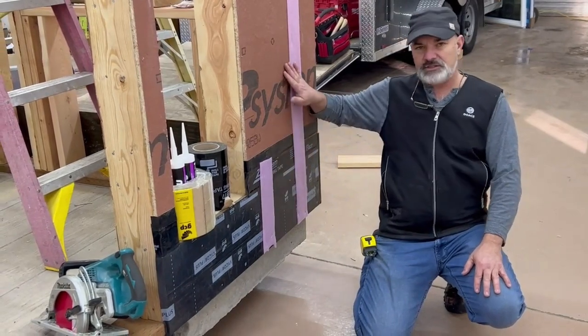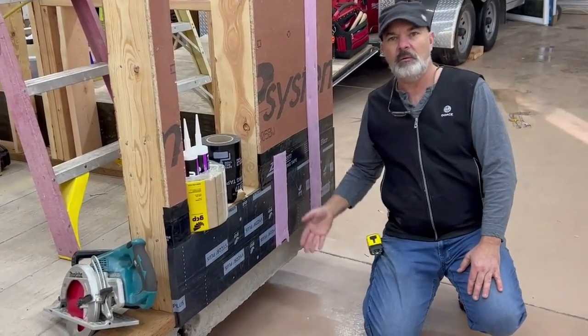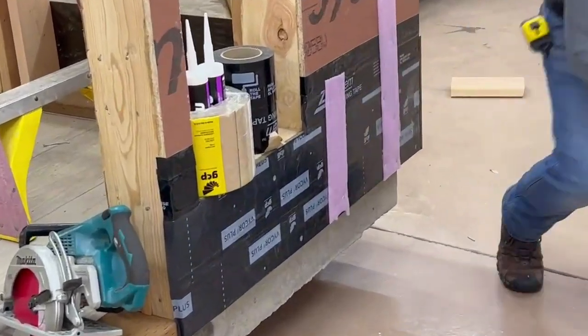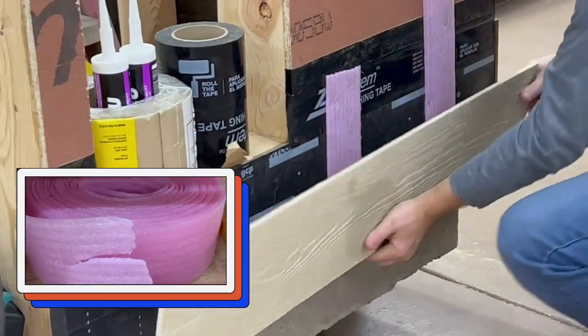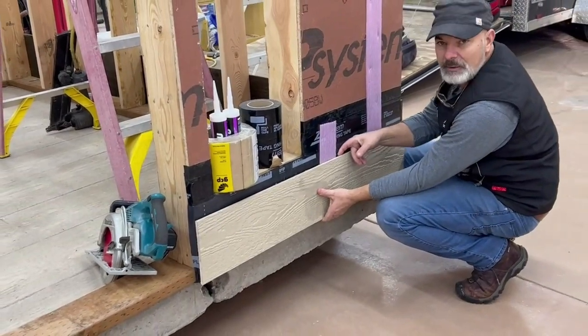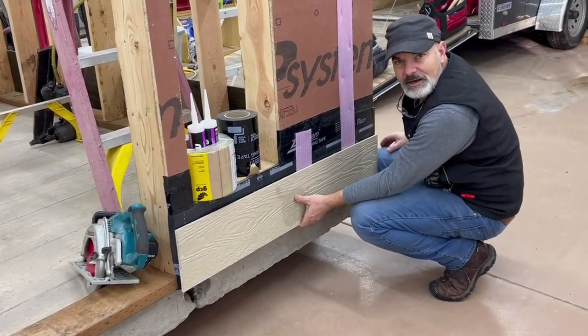As you will see, this is a super cheap, easy way to get some air flow in here so that if water ever does get underneath that siding, we put a little bit of foam on there, put our siding on, and it gives us this perfect little gap so that we can get some air flow in there and everything dries out. We'll see you next time.